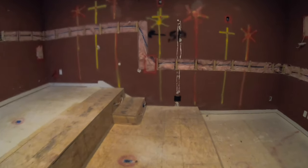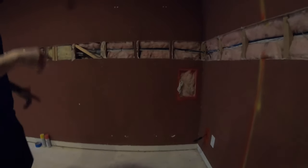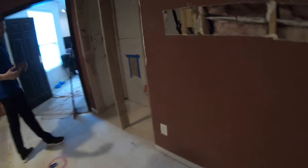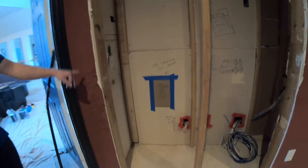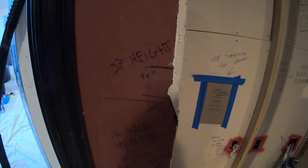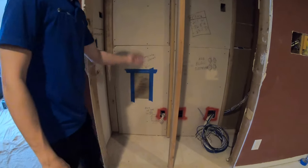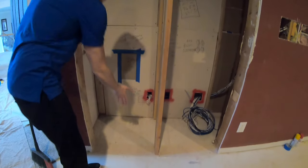Surround left and right are right here at ear level, which will give us optimal performance. In the rear of the room we have our rears, also right at ear level. I took the specifications of the seats the customer chose and used that to make sure the tweeter is firing straight into their ear. Over here we also have the subwoofer termination for our second sub and our rear right — I've got it written out for my guys so they know exactly where I want the speaker when they do the built-in. I even left a cutout template and the line pulled right up so it inserts into the wood.